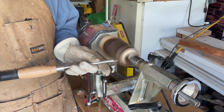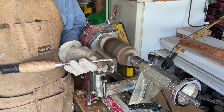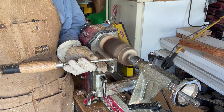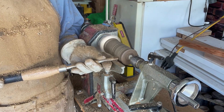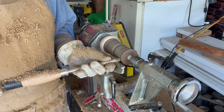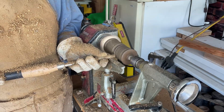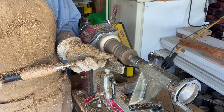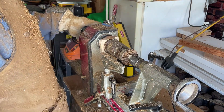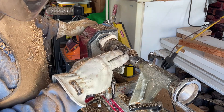Cruising along making this new cup here. The thing is I used these little blanks that were left over from pen blanks, glued them all together, tried to make a neat little pattern out of them. It's end grain we're working against here, so this is why I'm using a carbide tip. This is a really hard wood — not sure which one it was.